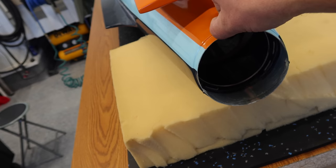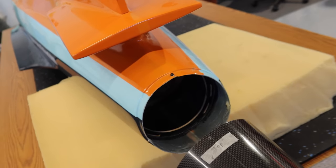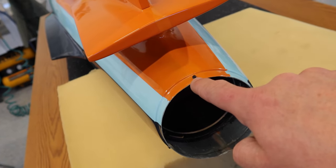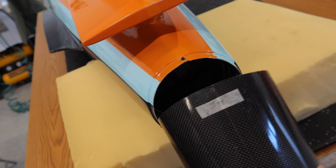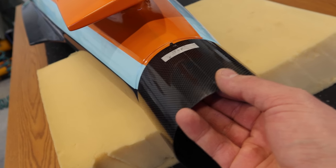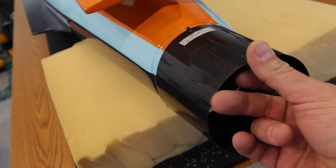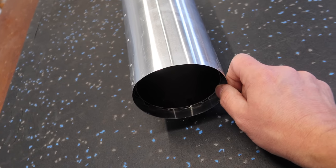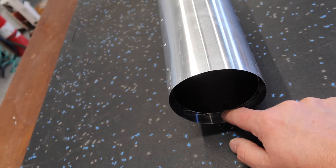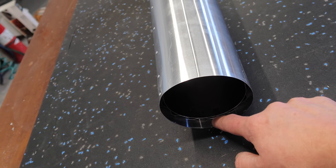So what we're going to do now is get the pipe installed in the aircraft, and get the carbon rear exit installed on here so we can get our pipe spacing. Now this stuff's all pre-done for you as well, and it's all marked out. We've got our blind nuts and 2mm screws all completed already by Hispano Aviation. They've marked the top of this cone, and that gets installed like that. We basically want to have our pipe flush with the exit point here.